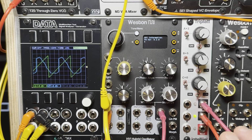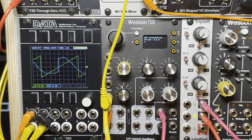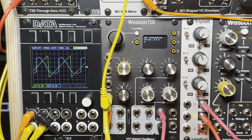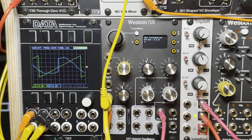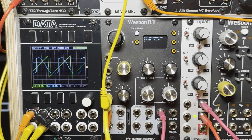To upgrade, the procedure is in the manual in the back, but it's pretty easy. You put the binary file on the SD card and make sure there's only one binary file for the firmware — the one you want to update to. With the module off, when you turn it on, hold these two buttons, the right and down. While it turns on, it will come up and prompt you saying this is the firmware update. You can bail out at that point and turn it off, or follow the prompts, hitting the plus button to erase the memory and then install. Then it will say it's complete, hopefully, with zero errors, and then you reboot.